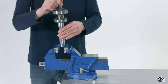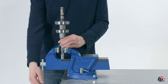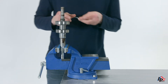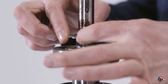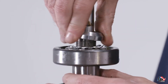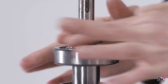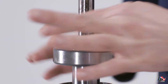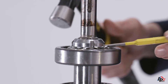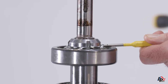Secure the pump drive shaft with installed bearings and spacer in a vise with the keyway facing up. Install the lock washer and lock nut. Use an appropriately sized or adjustable hook spanner wrench to tighten down the bearing lock nut. After the bearing lock nut is tight, bend the tab on the lock nut washer to prevent the lock nut from coming loose while the pump is in service.